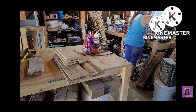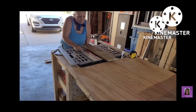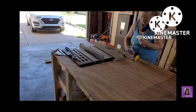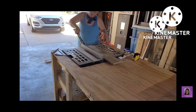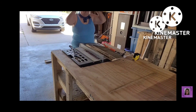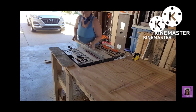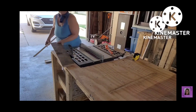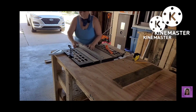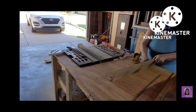I'm just getting all this wood completely cut so I can start putting them together. Now I've brought them over to my table saw. I'm bringing the blade up and you put your wood next to the blade to make sure the blade is above your wood. I'm setting my guard and pushing the wood straight through using my little pushers, trimming or ripping the wood to get it the exact size I want. Because I'm adding two pieces of wood together, you want to do this so you can join them and get a good bond between the two pieces.